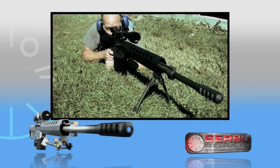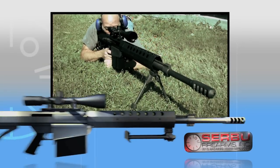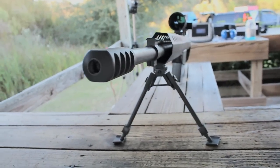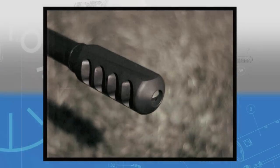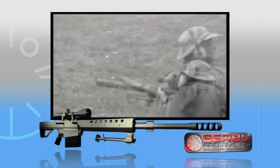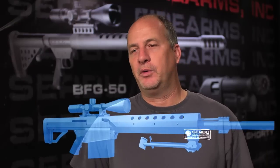I made it a gas-operated design with a fixed barrel. Trying to make a rifle accurate with a moving barrel is nearly impossible. The same goes for having a very effective muzzle brake — you can have a really great muzzle brake, but on a recoil-operated gun it won't even function because it will stop the barrel from coming back. Another great thing about having a fixed barrel is that the gun is unaffected by the addition of a suppressor. The BFG 50A's gas system is a direct impingement type and uses a gas tube similar to what's used on an M16.